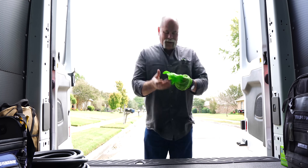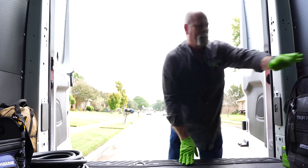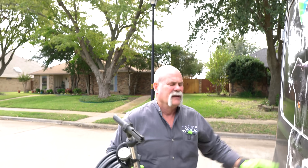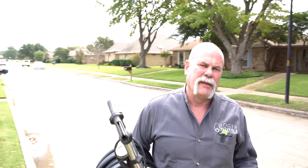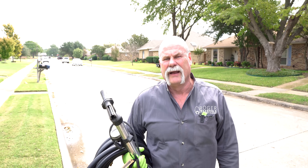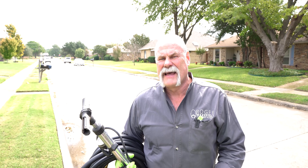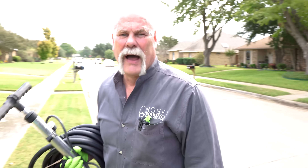My biggest concern is to do a sewer test to see if she has problems or not. The other companies already came out and put in a two-way clean-out — not sure if that was the first company or second — but somebody spent time and money to find out the right way. So let's test this and see what happens.